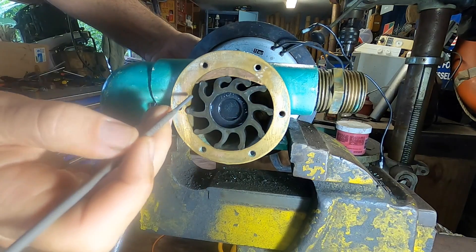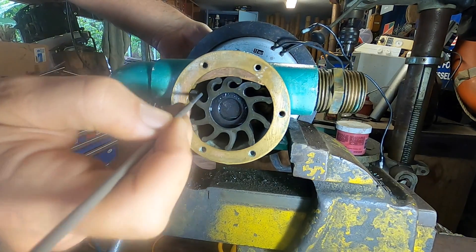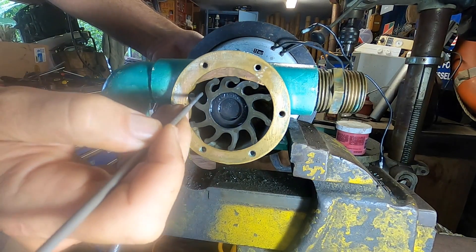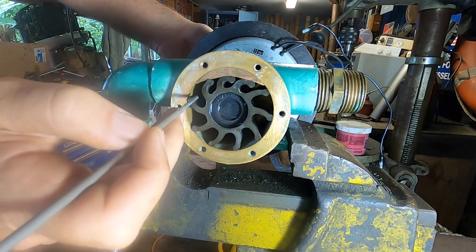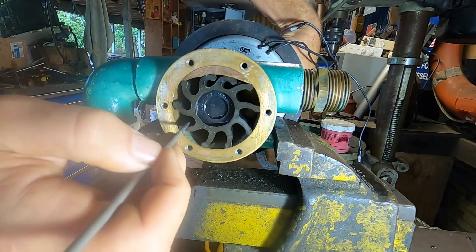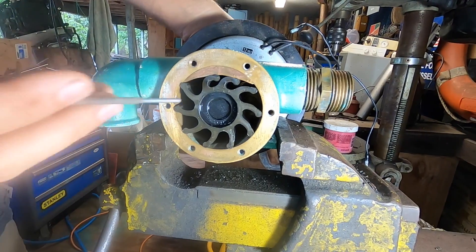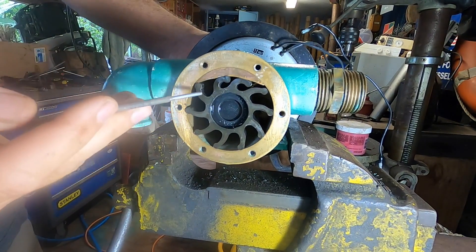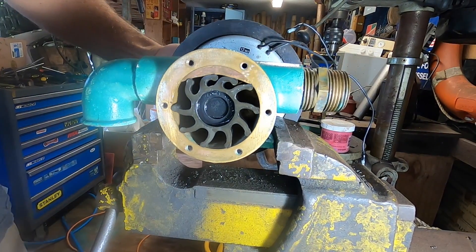And this is happening over and over. This chamber expands, pressure lowers — the pressure differential between atmospheric pressure and this pressure draws water in, and air. This is why they can self-prime, unlike centrifugal pumps. It fills the chamber, carries it round to the other side, and that process just keeps repeating over and over — shrinking the chamber to give it a positive pressure, expanding the chamber to give it a negative pressure. So they really are that simple.